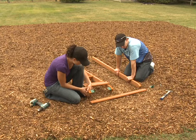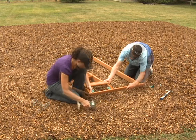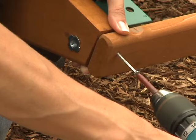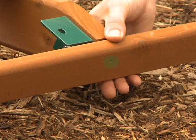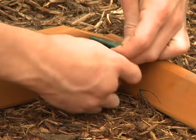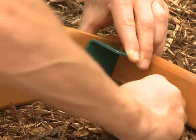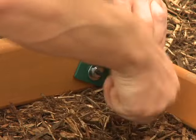Place the 024 rock rail on the ground next to the right access rail so it matches the orientation of the two access rails. Attach the 025 top ladder to the top of the access ladder assembly and rock rail using 3 S3 wood screws. Notice that the holes in the board are towards the top. Attach one swing bracket to the top angled edge of the rock rail, making sure the bracket faces out. Use 1 WB2 wafer bolt with flat washer and T-nut.